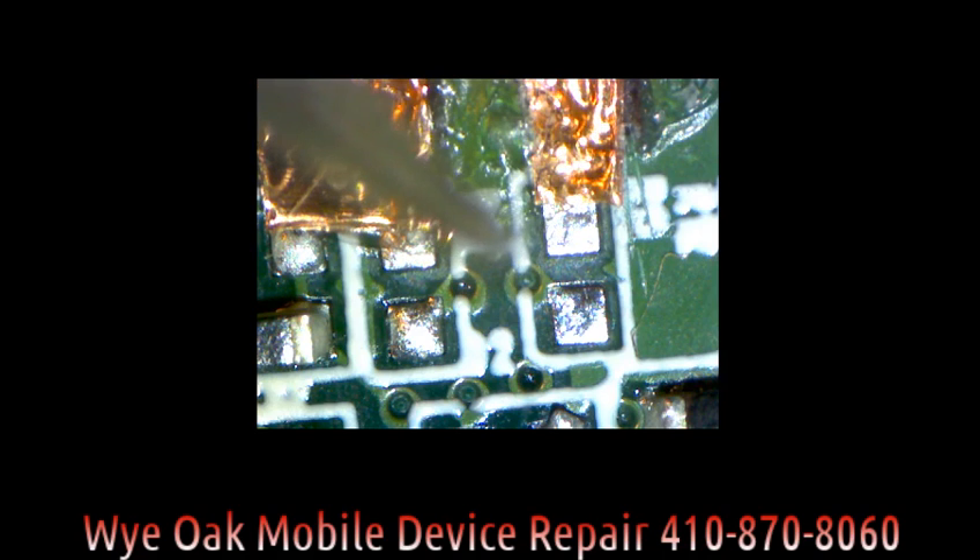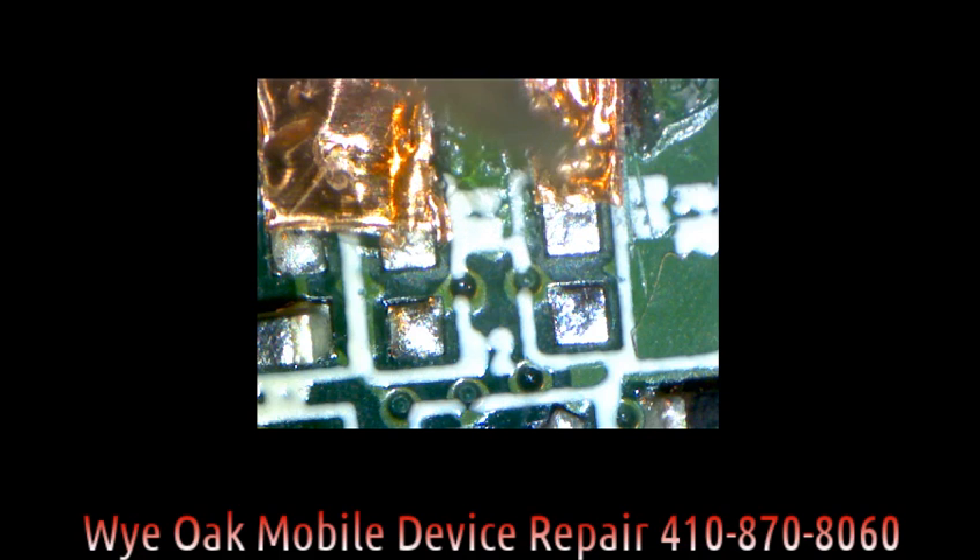There's the head of my precision tweezers, and these are the pads here — right there where my tweezers are — that's the replacement pad I'm putting on. I'm letting the epoxy cure, and then I can cut around the copper foil.